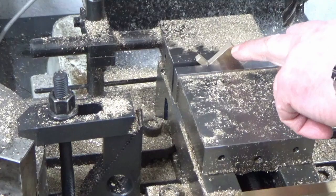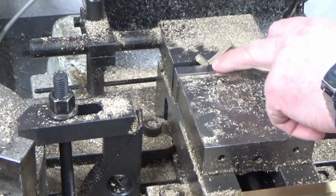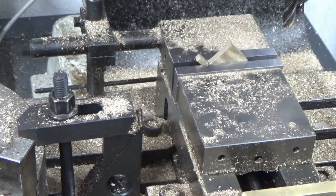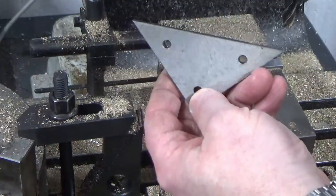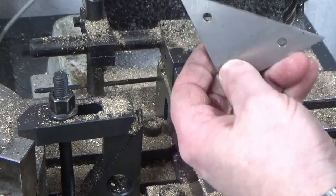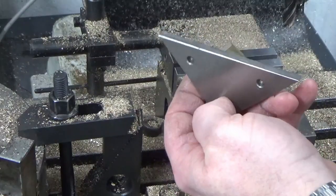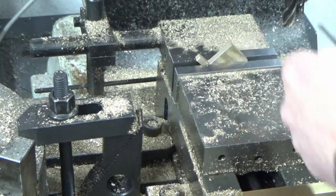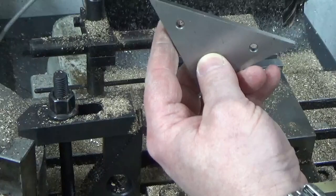Just thought I'd show this setup. So it's 45 degrees the angle I need to put the bevel on, so dead straightforward. Oh, you'd have thought so. So I've got a 45 degree ground square, but unfortunately that is just slightly thicker in section than the brass bit, therefore the vice is clamping up on this first.